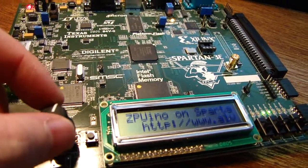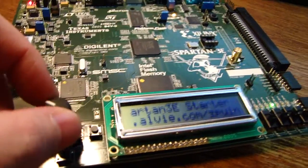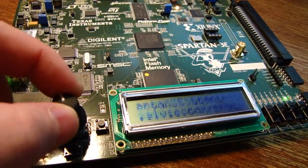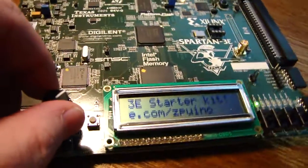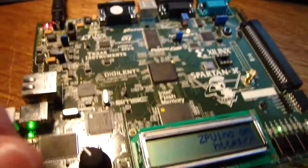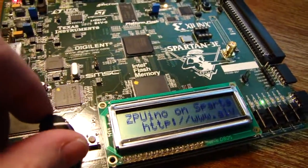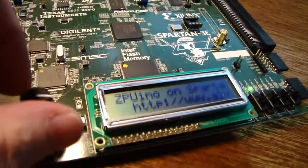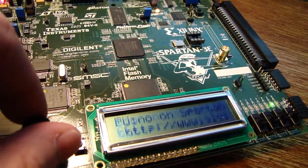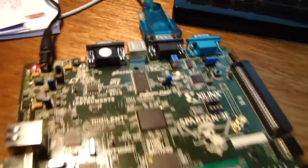Well, it wasn't easy to set up. My Windows setup getting Xilinx's tools to work in Windows 8, then going over to my Linux box and realising that none of the Arduino stuff works very well because the RXTX library that Arduino uses — the native JNI library that comes with it — is crap and never works in Linux properly. Then finding out that the bit file loaded onto this FPGA caused a timing issue. The one on their website was not compatible with my board, but in a newsgroup somewhere the guy who wrote this put another version 1.01 of the bit file which had the right timings. I finally got that working on my Windows box with a serial USB cable, which was again another nightmare in Windows but worked first time on my Linux box.